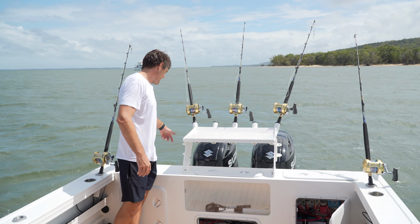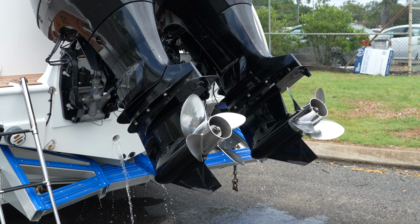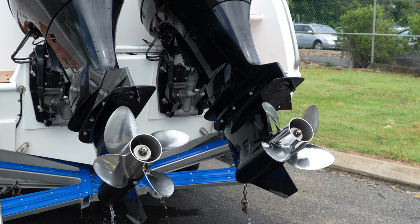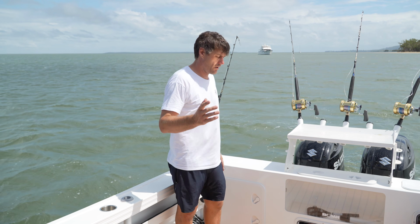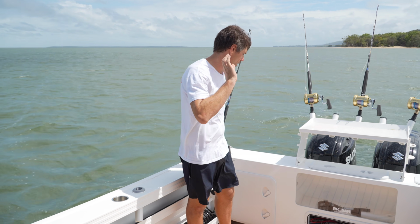Hydraulic steering. Down on the transom, we have got a 1 kilowatt transducer, and underneath the boat, we've got a fairing block with twin 1 kilowatt trannies. So there's 3 trannies. It reads awesome. I highly recommend the fairing block. No bubbles under there. We can be punching 70k an hour and this thing reads perfect.